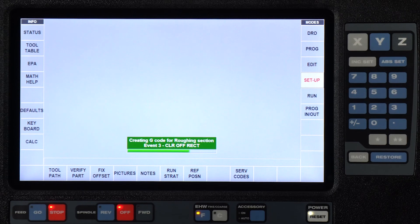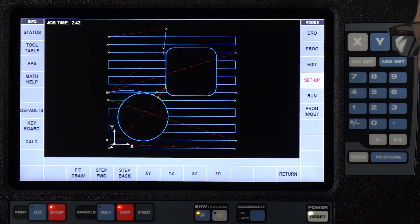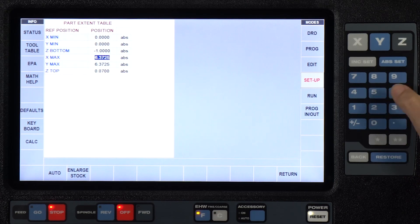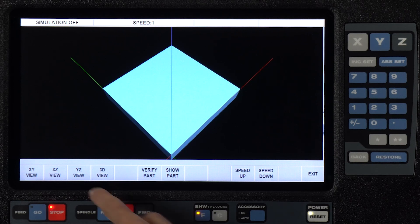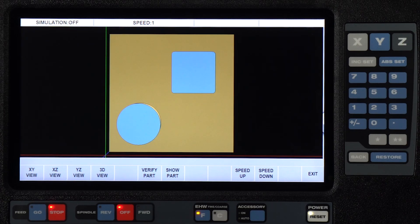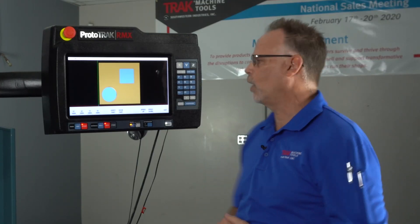I'm going to call that tool number one, close the tool table, and go to the setup mode and select toolpath. Once it calculates the toolpath, you're going to see that using the parallel design, it's going to remove all of the material until everything is gone. Now to give you a little bit clearer identification of this, I'm going to go to Verify Part. I'm going to define my stock — remember that corner is zero, zero. The part's actually an inch thick. The other side is six and six, and the top of the part is Z zero. So hit return, go to make part. And as you can tell, it starts from the outside, removes all the material, and leaves your profile standing. Super in the way that it works manually.